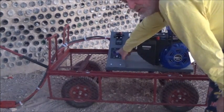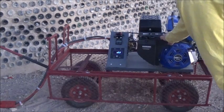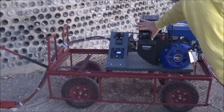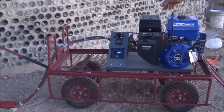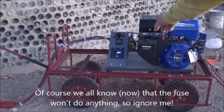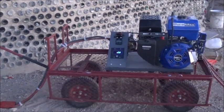Let's choke it up and see what we have. It says 12.3 right now. We're going to choke it, let's fire it up on low speed — here we go. It jumped up immediately to 12.8, but I haven't engaged the fuse yet. Now engaging — it's connected to the main system at 12.8 volts. Six hundred and sixty RPM.